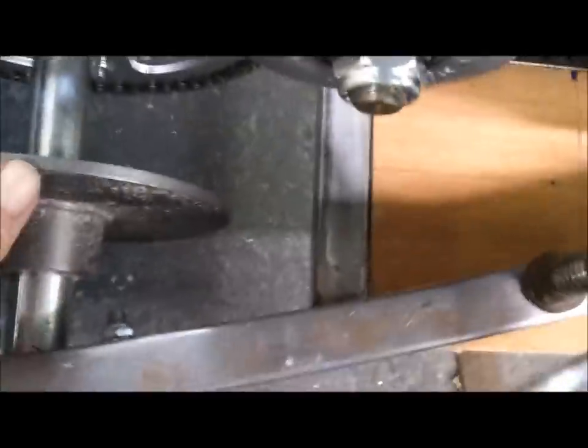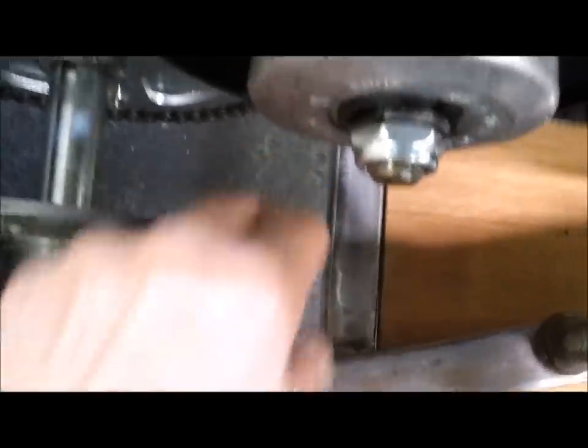So then I had to make sure that when I bring the body around, there's going to be a post here in the corner. So I'm going to change this to a K&N filter, which will be down low and behind that corner post. And then right here, this will be changed to a header, which will turn and come out beyond this corner post. So that's important for the body attachment at the rear. And then this will end up being just right there, but that'll still work. And then there's adequate room here for me to make a bracket and put the caliper right there.